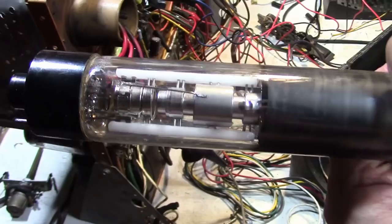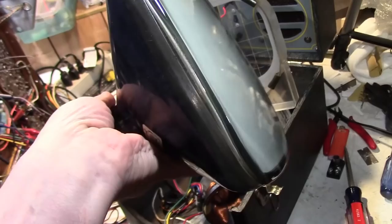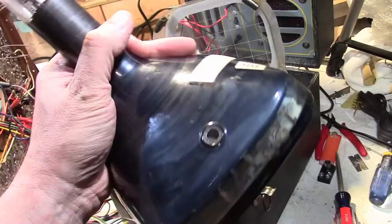What that means is no ion trap magnet to fool around with, no focus coil. The downside is it will develop a burn in the center of the screen. I've seen some of these that have seen a lot of use — there's definitely a brownish or dead spot in the center. But it really doesn't matter because you're using this as a substitution for the main CRT just to get the set working. Now and then I see people thinking they could use these as a replacement for an 8-inch picture tube in a TV, but it's going to get an ion burn in the center. As for the rest of it, it's crudely made — here's the plastic front. It does have some crazing and stress cracks.